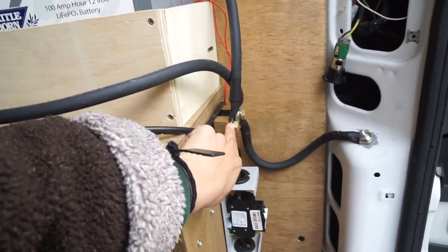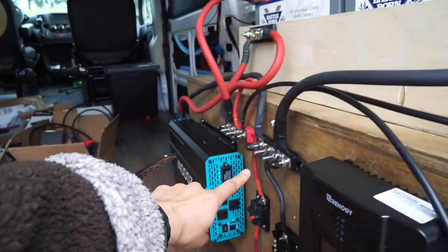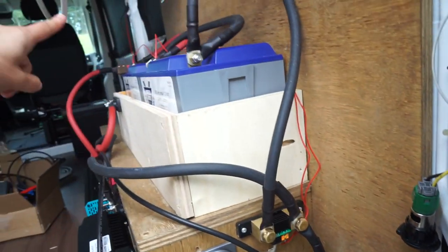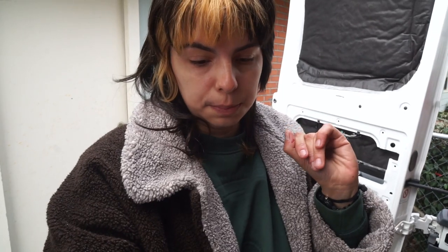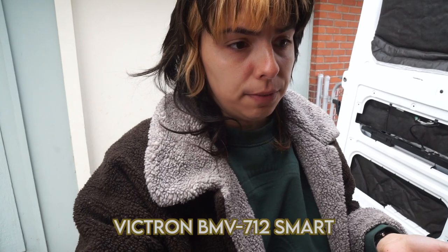The negative side of the battery goes down to the battery-only side of the shunt, and on the other side of the shunt it goes to the negative bus bar. Another wire goes to the chassis ground, which will be important for the AC system later. Two wires connect up to the positive sides of the battery and help monitor the voltage and the percentage capacity the battery currently has. I'm not going to explain how to set that all up because Victron Energy has a really good step-by-step guide. I bought the BMV 712 Smart, which also has Bluetooth capabilities so you can monitor your battery from your phone on an app. That concludes all of the connections from the battery to the bus bars.